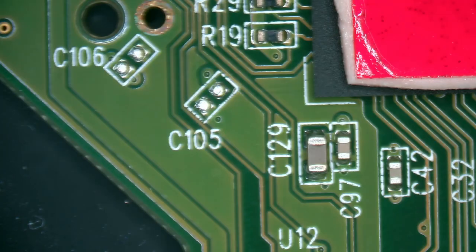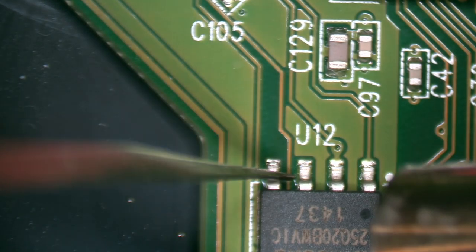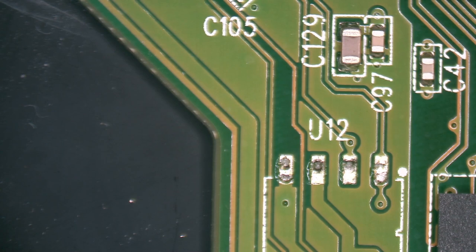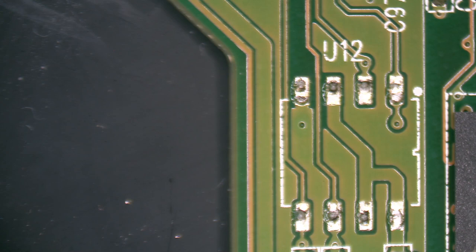We're going to move over a little bit because my solder mat's bubbling up. It doesn't like the heat. It can take it, but it... Now that's how it should do. See how quick that was? That was less than 5 seconds. I couldn't even get out 3 words before that chip popped off. That's how it's supposed to go. All right, and now we'll swap chips here. We're going to put a little bit of flux.